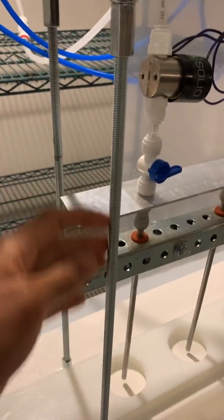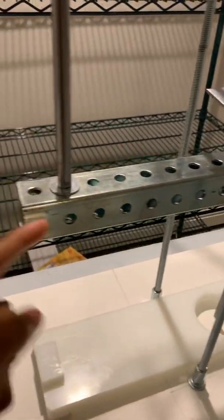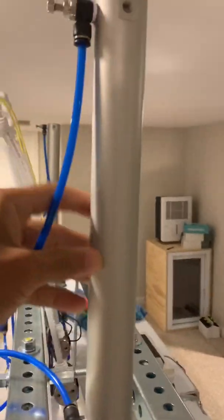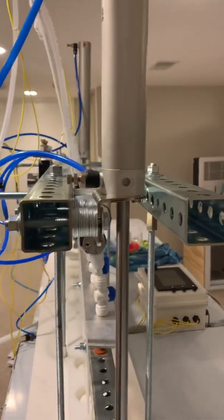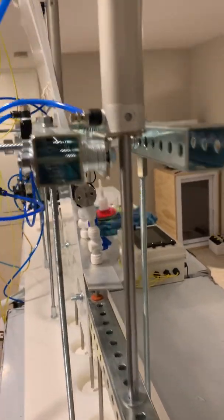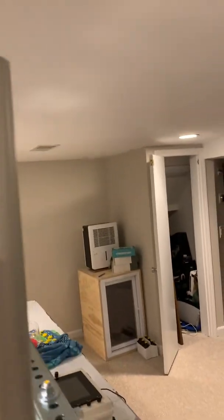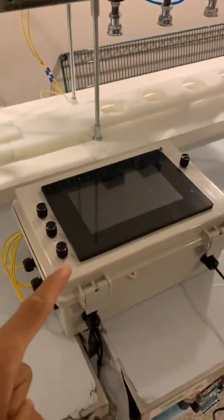This equipment here is all Home Depot parts — literally threaded rod, nuts, washers, lock washers — and this contraption is perforated square tubing. This is the air cylinder, about 10 or 12 inches — typically measured in millimeters. The air cylinders are responsible for making this go up and down. I've got one on each side because they control the filling head. They're driven by air pressure from a compressor and have adjustables so both can go up and down simultaneously. There's also the air valve solenoid, which I control with the Arduino.